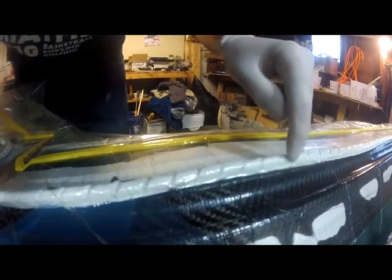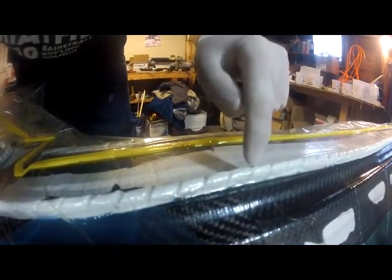That's a shot of the sponson — it's the leading edge — and the vacuum line there. I should have used the hose with the fiber reinforcement because it did start to collapse over time. I let the vacuum pump run for 24 hours just to make sure the resin had time to kick, but I should have used a slightly stiffer hose. You can see here the epoxy is running alongside the MTI hose and not going inside it.